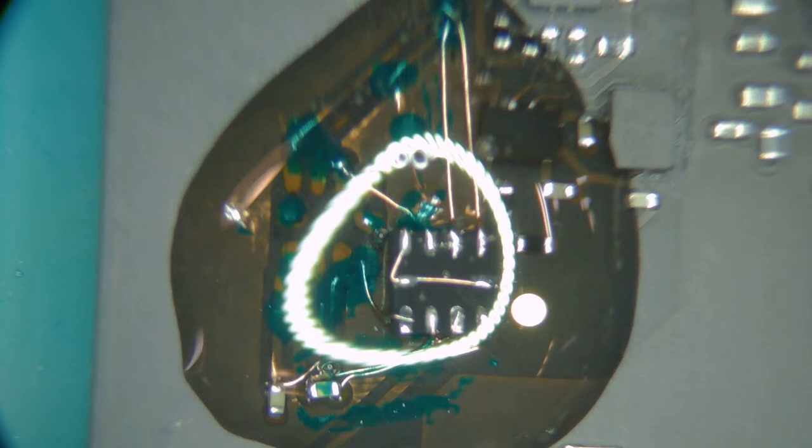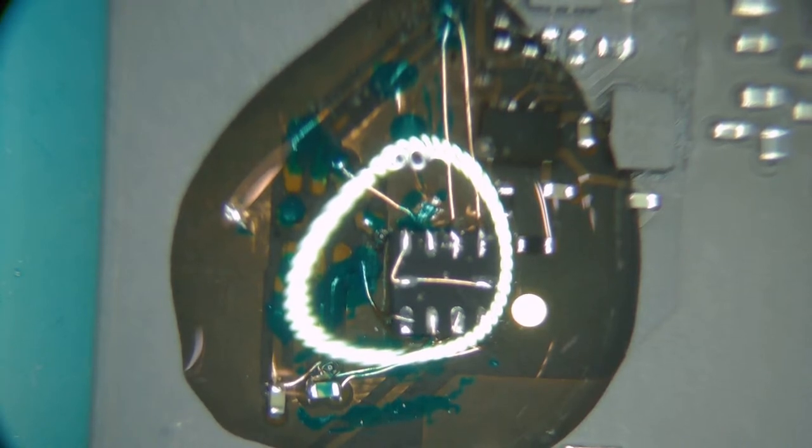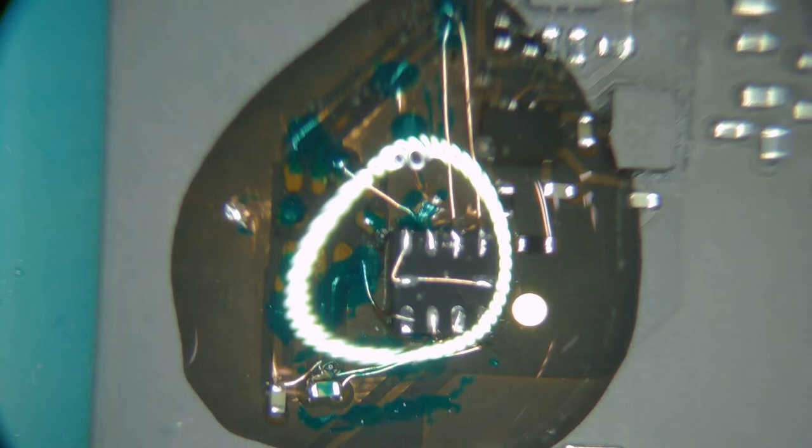So also, when you put hot glue over something, you want to make sure that it's extremely dry. So heating the board while you heat the hot glue makes sure that everything is dry. I didn't seal any moisture underneath there. And then as that cools off, that'll get a little bit more opaque. Yeah, now there's no way that somebody else can knock it off as easily, hopefully.